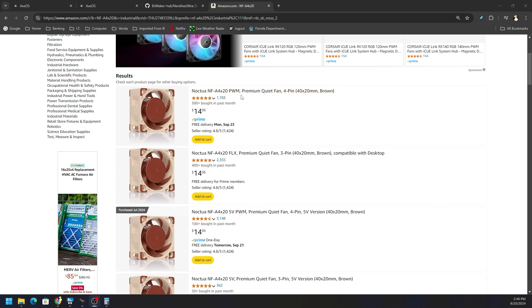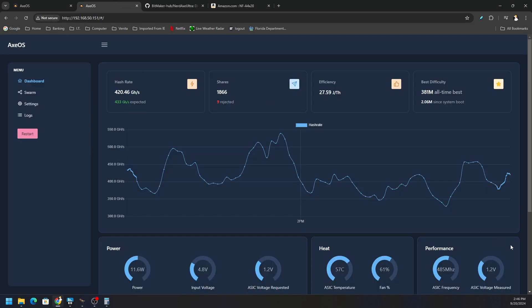This is the PWM version — it's a premium quiet fan — but look for the 5-volt in the title; you'll need the 5-volt version, not just any PWM version. The stock fan just makes more sense rather than doing this upgrade, considering the gains: we may have reduced noise slightly, temperature is about the same, and maybe a little better hash rate. But for $15, I'll let you weigh it out in the comments.